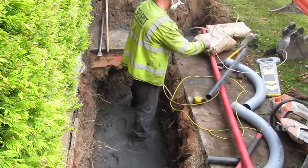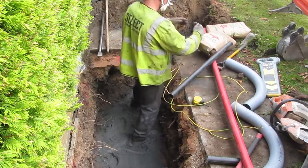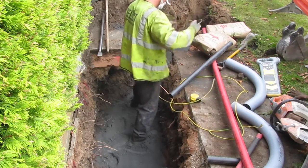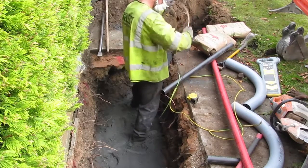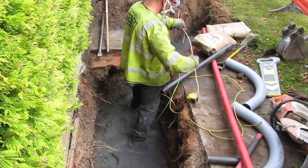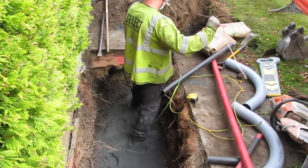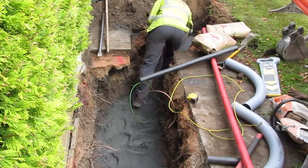After confirming the orientation of the cabinet, on which side the earth connection will enter, install a supplied 16 mm squared copper electrode, taking care to ensure that the copper is kept away from the edges of the excavation. Ensure that the insulated copper tail is in the correct position. Avoid the copper earth electrode being pushed through the conductive concrete and touching the earth at the bottom of the excavation.